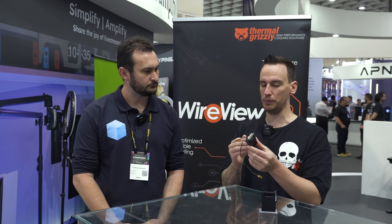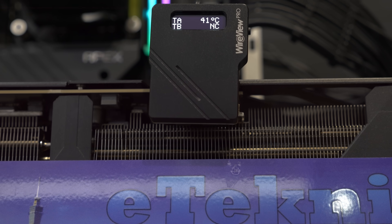If you have a typical air-cooled graphics card with this connector, we haven't seen any failures yet, so you'd be unlikely to run into anything. We don't want to cause more panic in the community — statistically it's very unlikely you'll be affected. But if something is wrong on the connector — whether the card, the cable, or this adapter — and you're running water-cooling, you already have 50 to 60 degrees Celsius higher operating temperatures, which is just more favorable for failure.